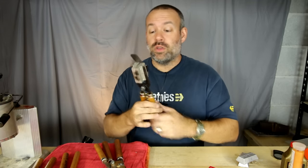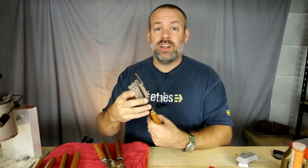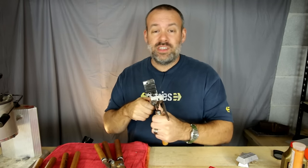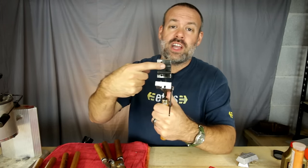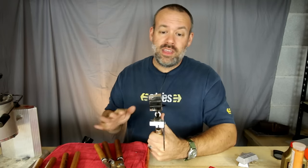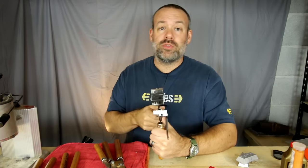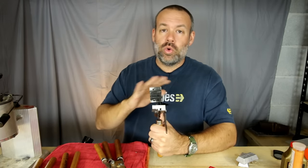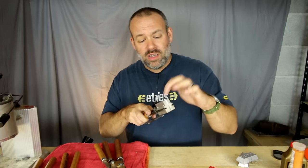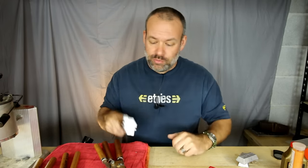The second thing you need to do is lubricate your mold. There are very specific little tiny spots you need to lubricate. The one place you don't want to get anything — especially any kind of lube — is the actual bullet cavity itself. Those little cavities need to be devoid of anything but the carbon from the smoking process. Everything else would actually affect the bullet fill out, so you just want to put lube in very specific small spaces.